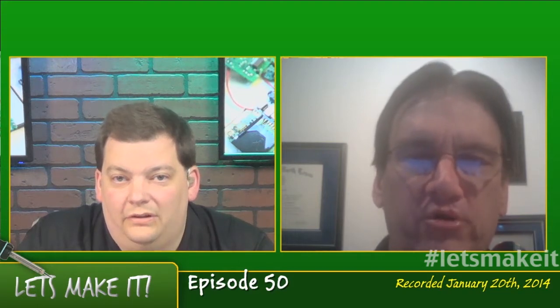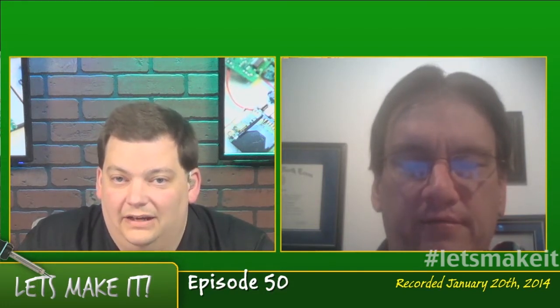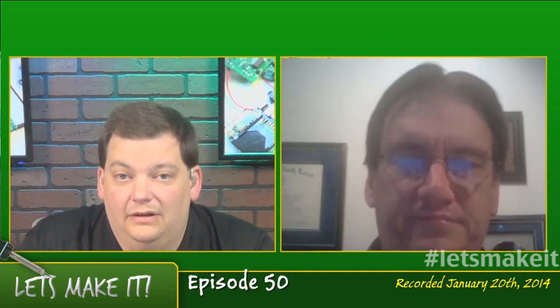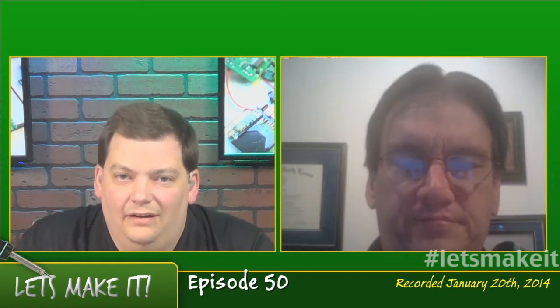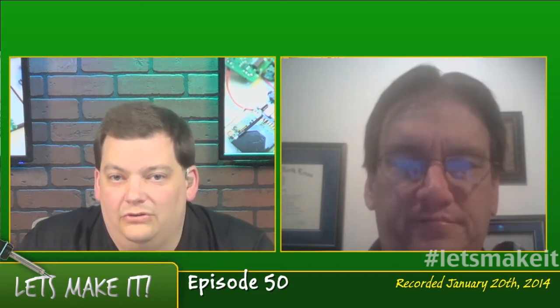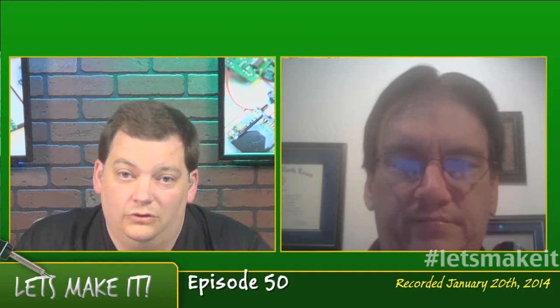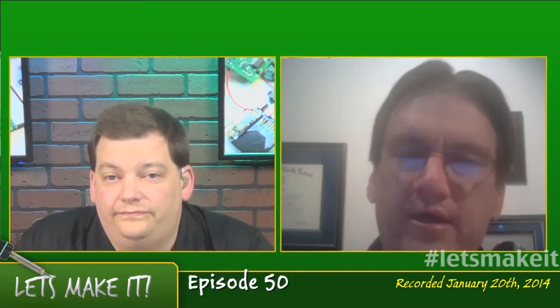Right. This person wanted to time a welding type machine. I guess they were welding something to batteries or something, and they needed exactly like 9.9 seconds, and they wanted to do it down to milliseconds, and they're asking me how to change it. I sent the code to basically wait for 9.9 seconds, 9,900 milliseconds, and they wanted to take it and put it into the same sketch, and then I need to reply to that. I don't think it's going to work. I mean, the way our time worked before was we waited 1,000 milliseconds to assume for a second, but if you put it down to 1, it would probably do what he's trying to do, but I don't think the display would handle it. Yeah, the display is not going to handle it.